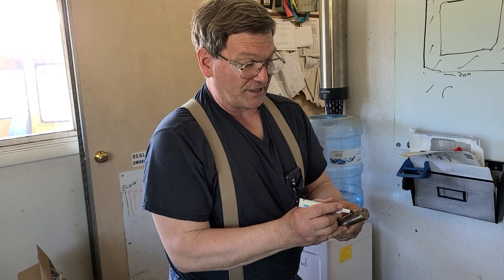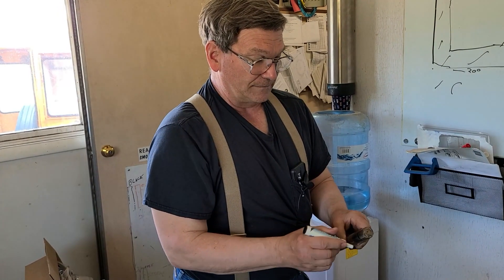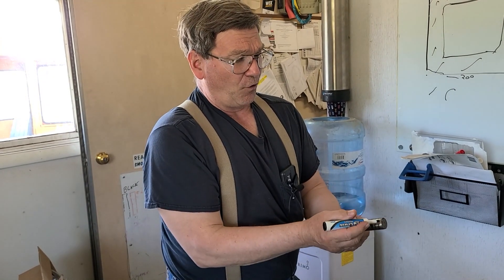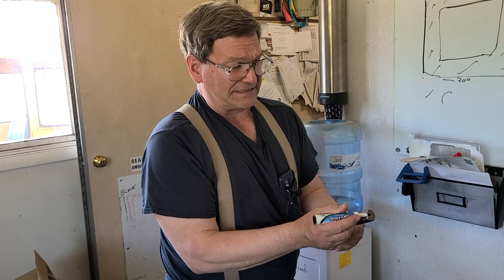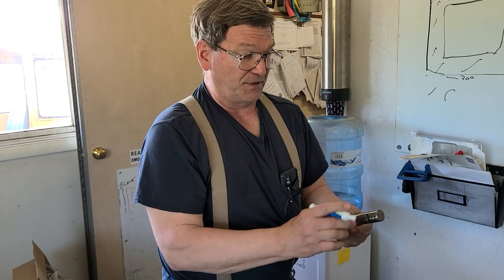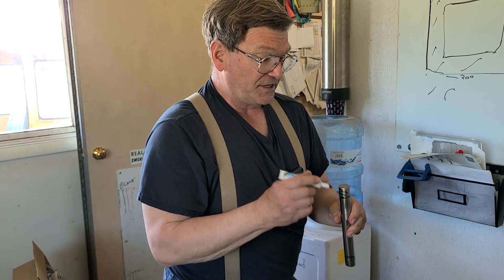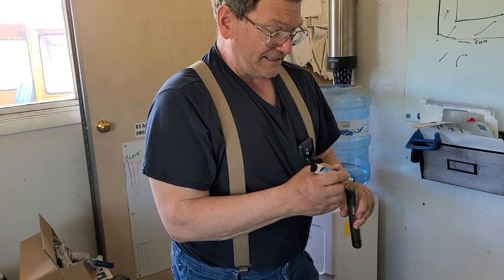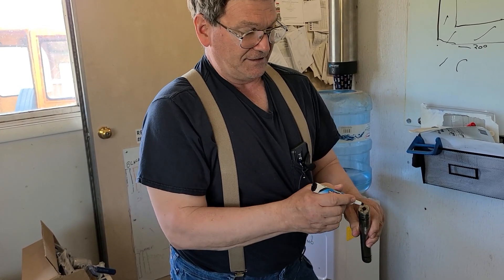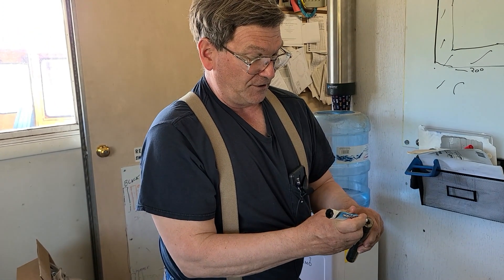Now here is what's key for the machinist — more so than the fact that you have left-hand threads. Usually you're cutting an undercut to start your threads so that it can go on all the way. The depth and length of the thread is somewhat important. That hole drilled in the side doesn't have to end up exactly at the mating point, but it needs to come somewhere close, and you want most of the threads engaged on both sides. The center is generally clearanced lower — counterbored a little bit — that's a common way this is done.